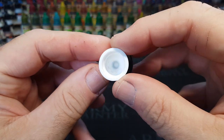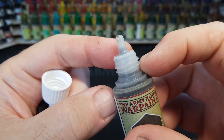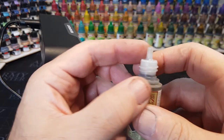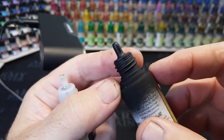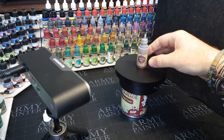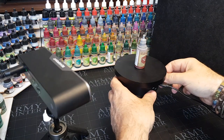So then I had a bit of a change of plan. Rather than scan the inside of the lid, it kind of made more sense to scan the outside of the lid, as there shouldn't really be any shadows caused on this. But I also had a few issues with that — the main thing was it's quite shiny. So bit of a learning curve: it doesn't scan black areas and shiny things either. So I thought I'd have a go with matte black — but even a nice matte black doesn't scan. So then I did a grey primer, and definitely got better results with this. It is a case of trial and error, trying new things, and just adapting as we go.